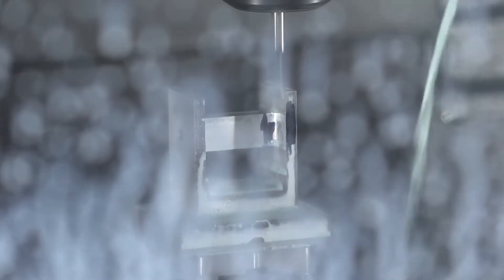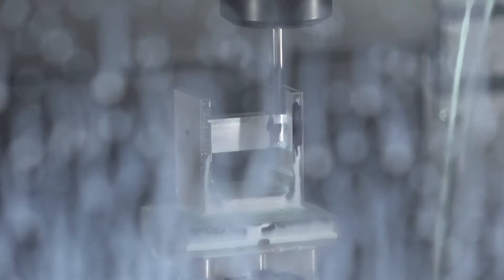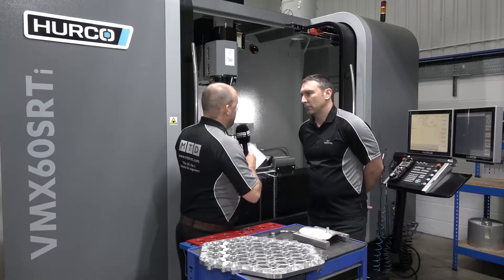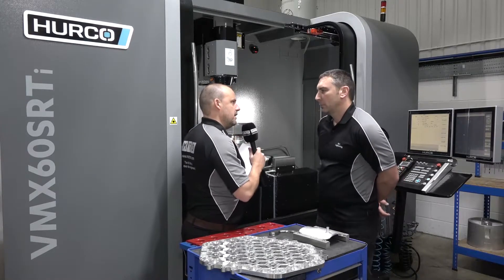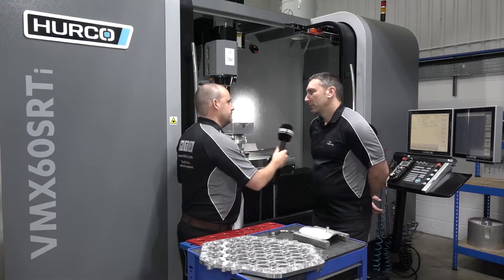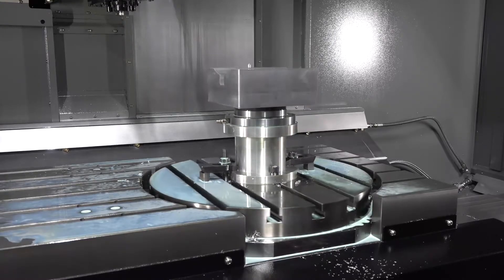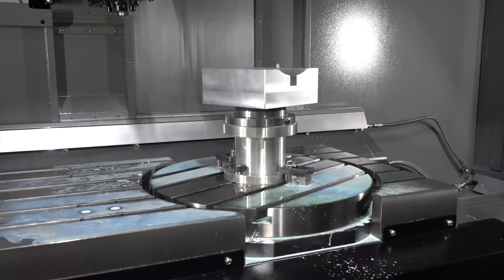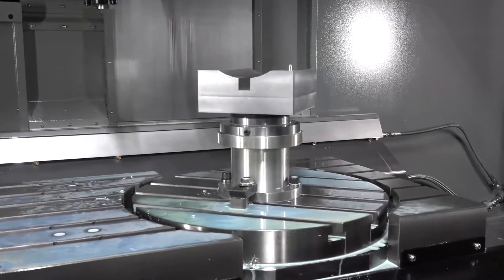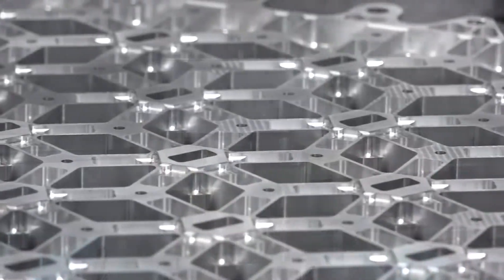I know you've got your VMX 30 UI as well, which is a five-axis machine - it's smaller and a different style of five-axis machine. What are the differences and do you think one is better, or is it totally application driven? It depends on the job. There's a lot of flexibility in the size of the component on there, rather than the 30U where you are restricted on the size of the component to a certain degree.